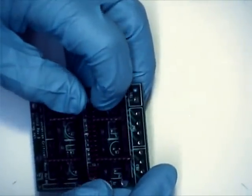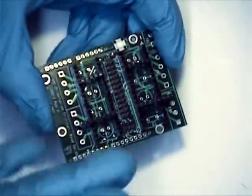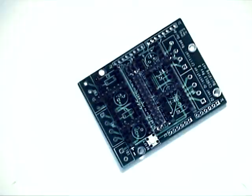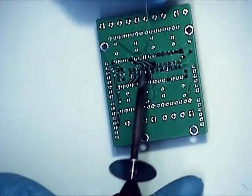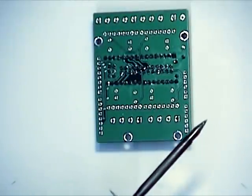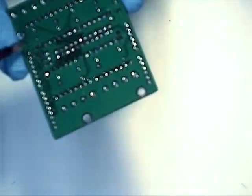We've got nice, even sockets — this one's a little off-kilter, just a little. These aren't perfect and they don't have to be perfect; there can be a little give. When you put the driver boards in, it's not going to matter. A little bit of wobble is fine — it's just real crookedness we need to worry about. I am going to un-solder and re-solder this particular set though. If you have a magnifying glass or a loupe, it's a good time to make use of it. Looks like we're kosher.